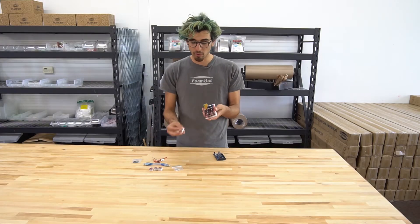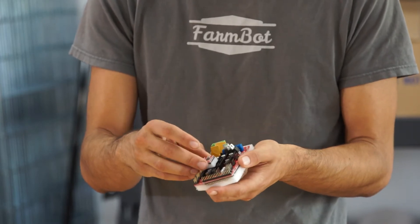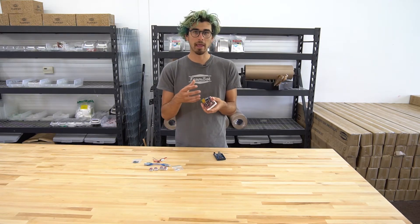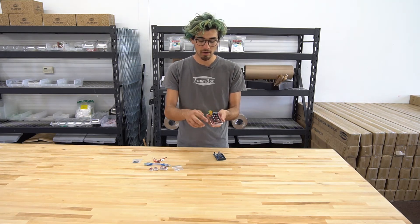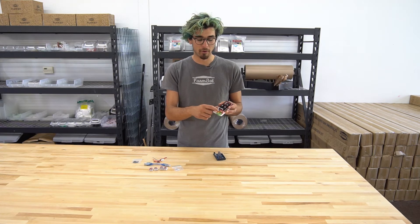On top of the ramps board are mounted the stepper drivers — there are four of these. They mount on top here, and those stepper drivers take the high power from the power supply and move the motors. The motors connect into these pins here, and we also have the encoders that connect over here and the peripherals over on these power terminals.